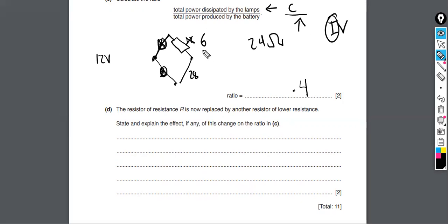If you put a bunch of resistors in parallel, you're decreasing the overall circuit resistance. Something like 20, 18, it keeps getting less and less. And so you're drawing more and more current from the battery. When you do that, the battery is producing more and more power. Does this mean we found some sort of unlimited supply of energy here? Just keep adding resistors in parallel, and the battery will produce ever more power until you drain it, okay?